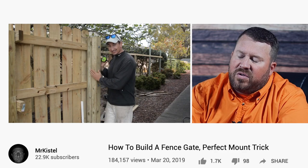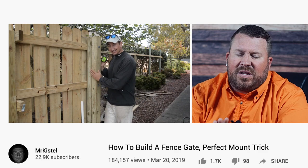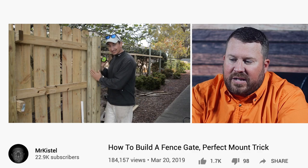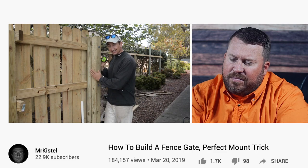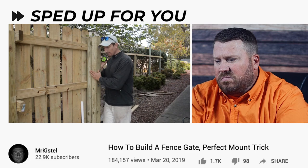A couple of thoughts here. The posts are concreted — that's obviously a great first step. He said he set those posts yesterday, and I'm not completely sure about that. Typically you want to let concrete wait at least two days. Unless he used rapid set — he could have very well used rapid set Quikrete — but typically if you're using standard concrete you want to give it at least 48 hours to cure up. Now, he's bolted two 4x4 posts together, and I absolutely like this idea. All too often we see sagging gates because the hinge post is undersized. So essentially he has a 4x8 post by bolting two of those together, which definitely gives him a lot of strength and stability. Usually I see the hinge post as a 6x6 wood post, so a 4x8 maybe gives it a little bit more strength.